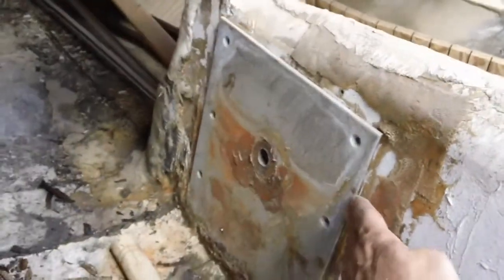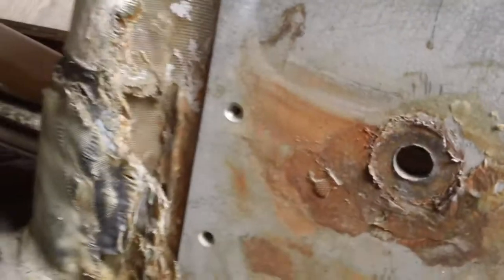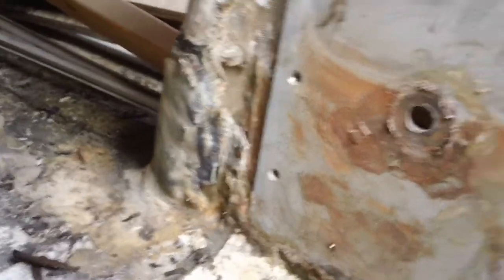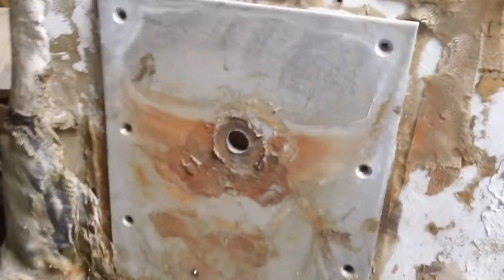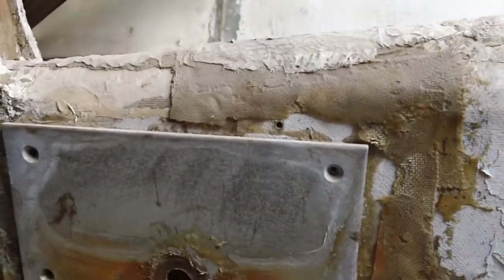See, they got a plate bolted on or glued on. And you can see all the damage in the front there. It's going to have to all be ground out. When they put those plates on, they put the swing pivot bolt in, but there's no locking pin, which is why we have all the damage in the front there. So that didn't help.